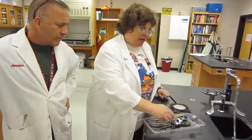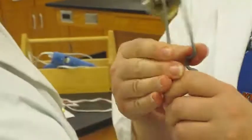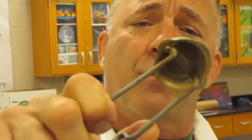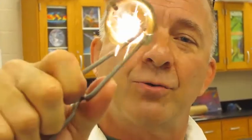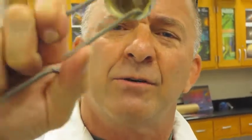Next, we have a Bunsen burner striker. This striker generates a spark. A lot of people have a hard time using this. You want to twist it — don't just move it back and forth. Back and forth produces not much, but twisting produces lots of sparks and lights it up. So if you're doing this 20 times and nothing's happening, you're doing it wrong. Start twisting.